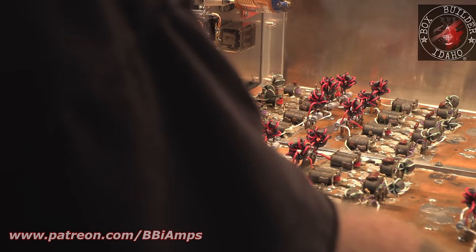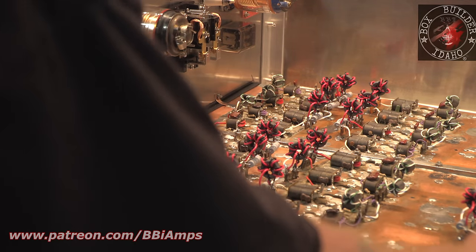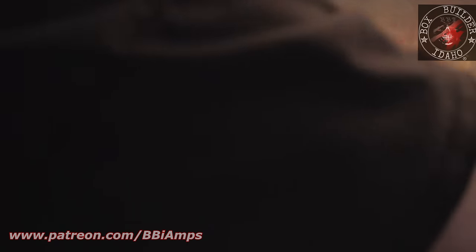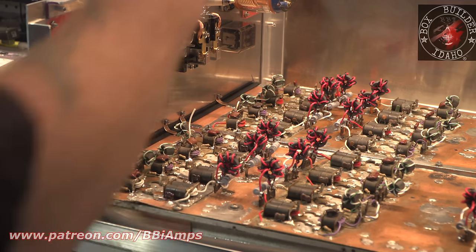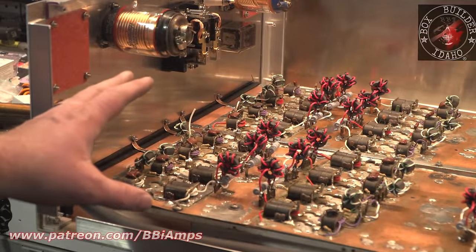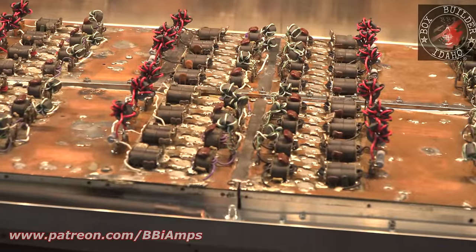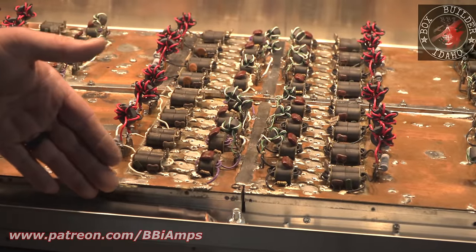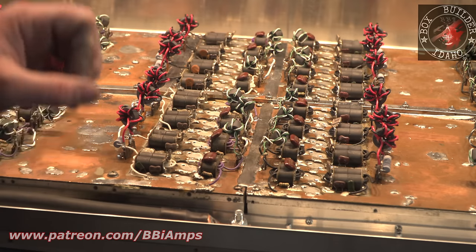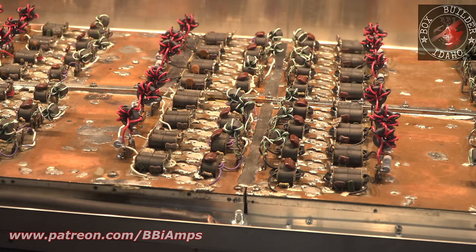We're utilizing the substantial metal mass of the two pieces of angle that are holding the side of the cabinet together to give us our common case bond, which is in the middle, so the current can flow outward. Now we have our common bond that goes down the middle. So a little bit of current will come from the back side of the cabinet, but a majority of it will come from the middle of the cabinet down this piece of not 4-gauge, 4-aught. So 1-aught lead times 4. This is the same as 4 1-aught leads, this wire.